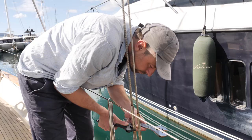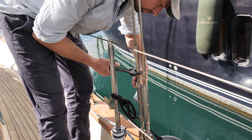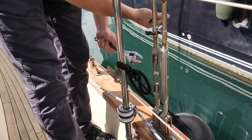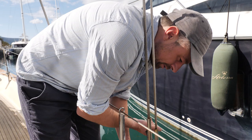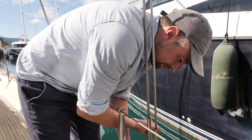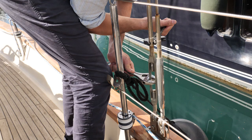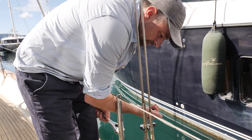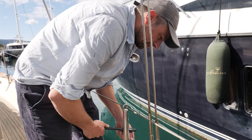Jade has a technique to make tightening easier when it's a bit tight. Rather than holding the stud at the top and trying to turn the body in a single motion, allow the stud to go with you, then turn it back — so you're only tightening one thread at a time, top and then bottom alternately. It just makes life 50% easier. Not an issue with smaller turnbuckles or big spanners, but most boats don't have anything much bigger than this.